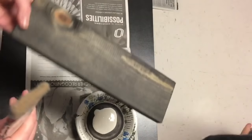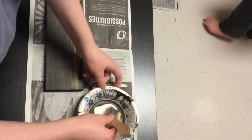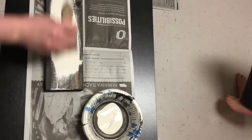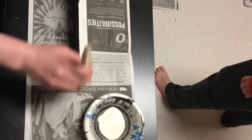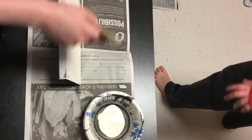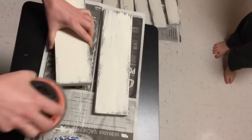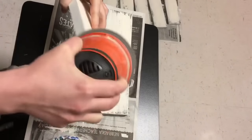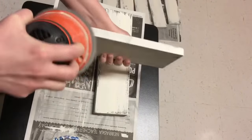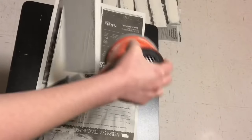I didn't do full coverage with my white paint because I did want a little bit to show through already. I just left some of that black showing through so it looked extra distressed. I did just the one coat and then I'm taking my electric sander and sanding that down — as you can see the black shows through and makes it look really old and distressed, and I love that effect. You can definitely use just some regular sandpaper if you don't have an electric sander; the chalk paint is so easy to sand off so it's pretty easy to do by hand too.